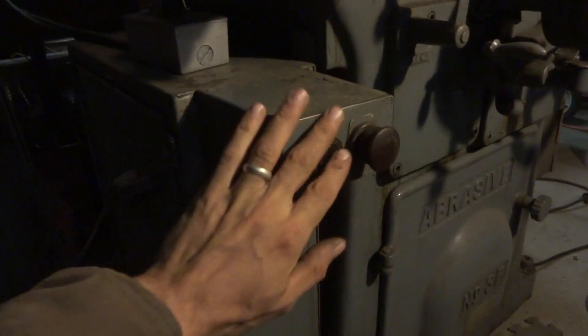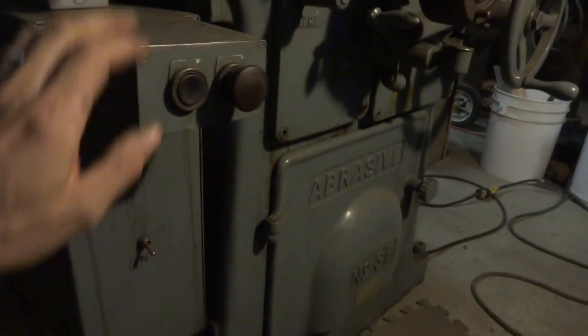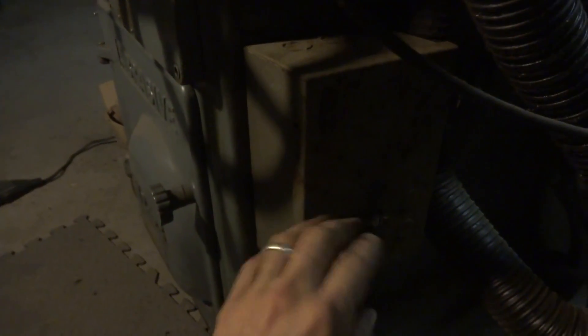There are several switches which are no longer operational — just electrical artifacts from someone's previous iteration of how to operate this thing. There's another switch that doesn't work. Currently one switch will cut power off, but I'm really operating it with run-stop on my VFD remote box. On the other side of the machine there are also electrical artifacts. This right here is the current magnetic chuck controller and switch, hooked via this cable up to the current chuck. However there's also a drum switch here which no longer does anything, running over to that box which is the old magnetic chuck controller. I also have a coolant system here — this is a drain hose for the entire table. I need to find a sump, and I've got a coolant pump that I can hook up once I get the sump together for wet grinding.